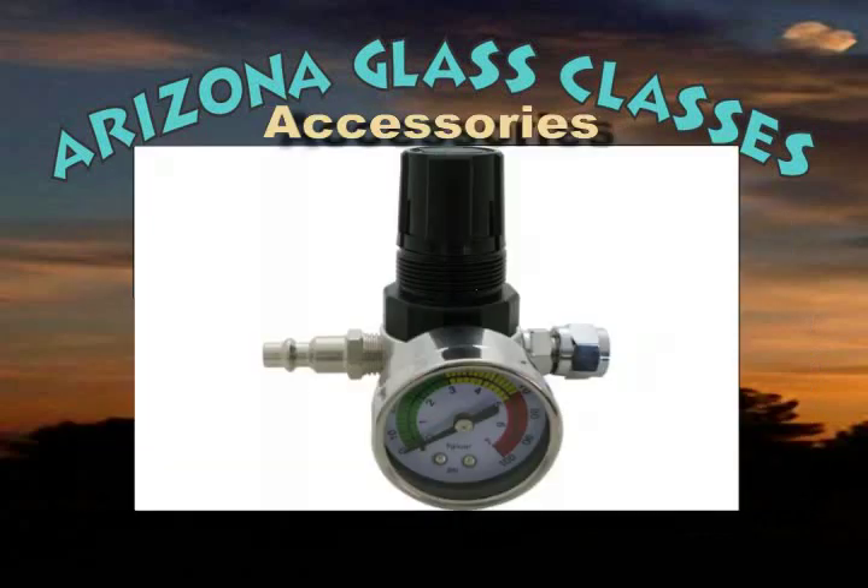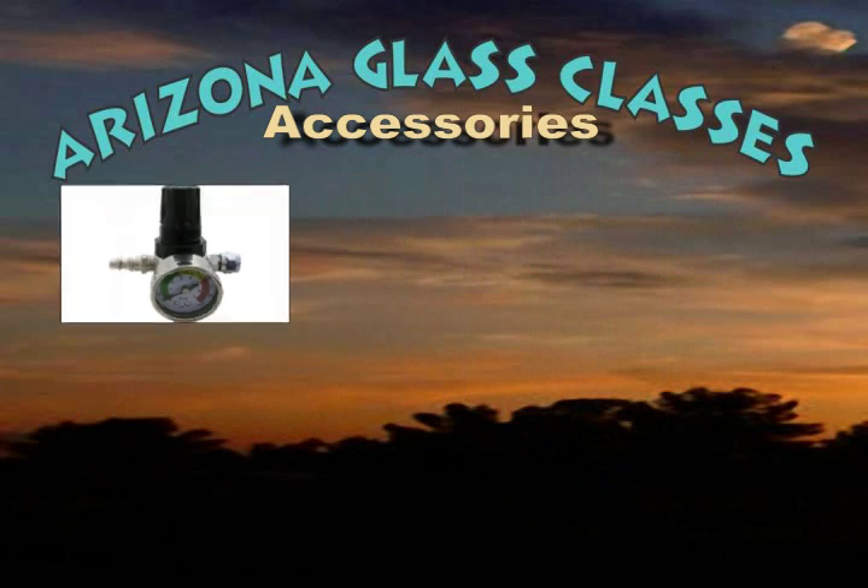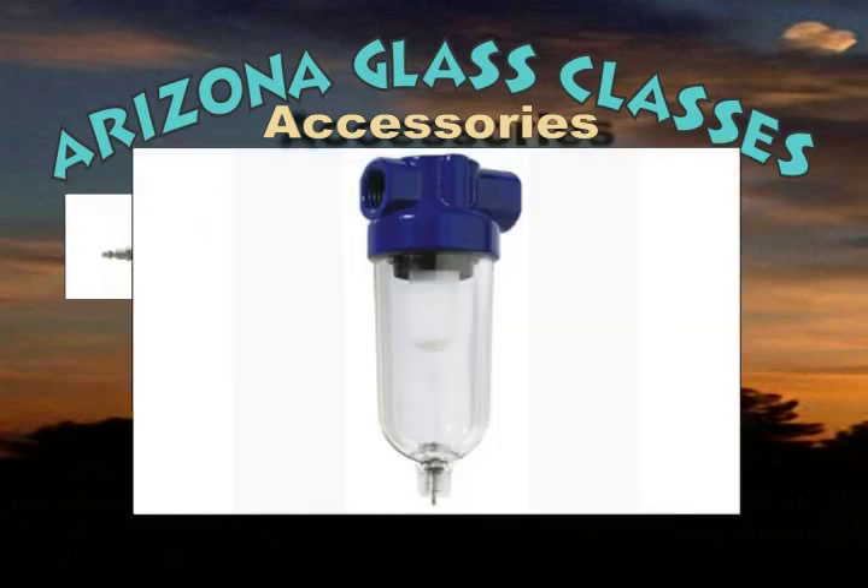You will need an air regulator to regulate the pressure of the air from the compressor tank to the pressure pot. Compressed air contains moisture, so your system should include a water separator to remove that water. There are several different types. It is preferable to choose one that has a clear bowl so you can see when it needs emptying, and it should also be easy to drain and positioned where you can easily catch the water.